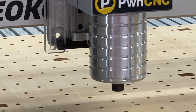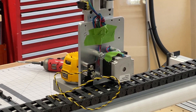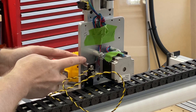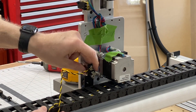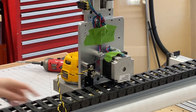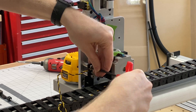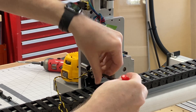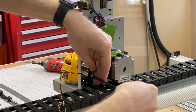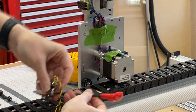Let's switch over to the other bracket and get that set up. Here we are on the backside. I'm going to reach around my installed HDZ and point out the limit switch. We're going to need to remove that using the four millimeter hex driver. We'll be taking over those screw holes for our ear, and then we're going to attach the limit switch directly to the ear.